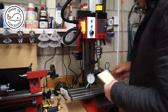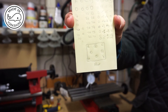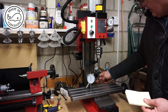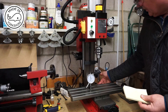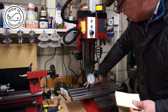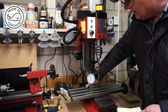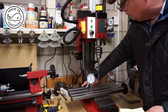After a lot of trial and error and doing quite a few measurements, I've ended up putting a feeler gauge on the right hand side underneath the column of 40 thou. And on this side of the column, I've just put a 10 thou feeler gauge on the front.